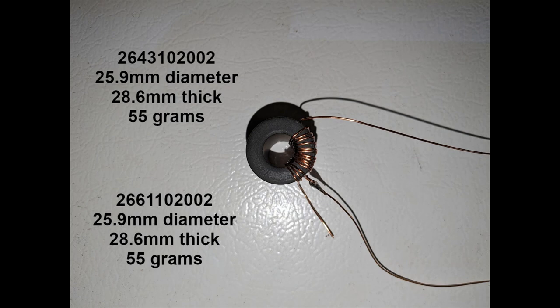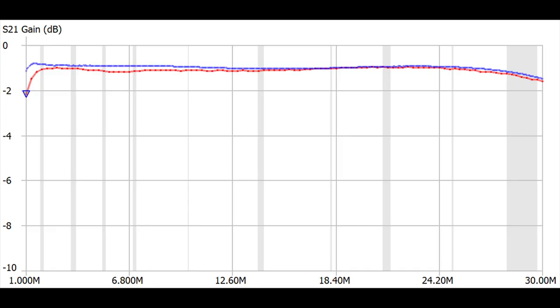Now, this is actually about two different pieces of ferrite that are exactly the same size and weight, but they are made of a different mix. For ferrite products, it's the third and fourth digit that tells you what mix it is. So you can see that one is a 43 mix and one is a 61 mix. But why would you do that, you idiot? The Facebook experts have told you, you can't use 61 mix. Didn't you hear them? They know what they're talking about, right? Wrong!